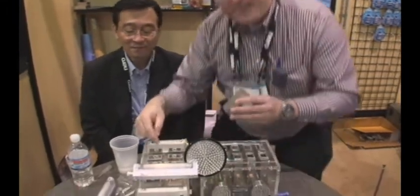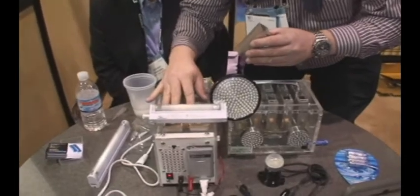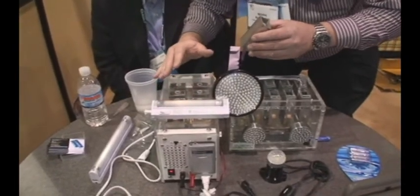What Tadashi Ichikawa has come up with, he's taken this to the next step. What he has done is taken the same design of the battery and put it in a larger form — 1.5 volts at approximately 1,000 milliamps. He has them in series here, and has put 10 of them together to get a 15-volt battery.